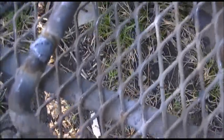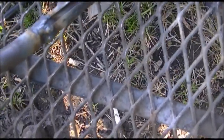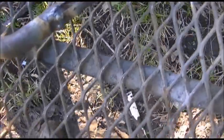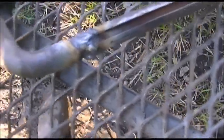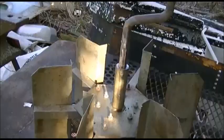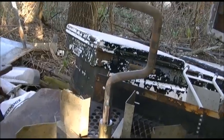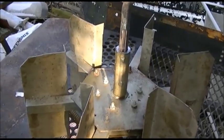I'll take it over to the anvil and make sure, then take it in on the grinder and smooth that up. There's not a bearing surface right there, it's just a connection and that should work fine. After I got it welded a little, I took my angle grinder and ground a V into the middle and welded from the middle back out, so the weld penetrates clear through the shaft which I think is about three-quarter of an inch. It fits quite nicely and it doesn't look half bad either.